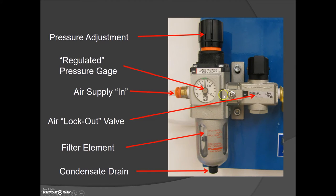Over here there's a lockout valve. When it's facing you or at 90 degrees to the piping it's closed. In order to allow the flow to go through you're going to have to push this valve so that it's parallel with the piping. Anywhere between this position and the open position you'll have air exhausting out of the bottom. There are really just two positions: closed and fully open.